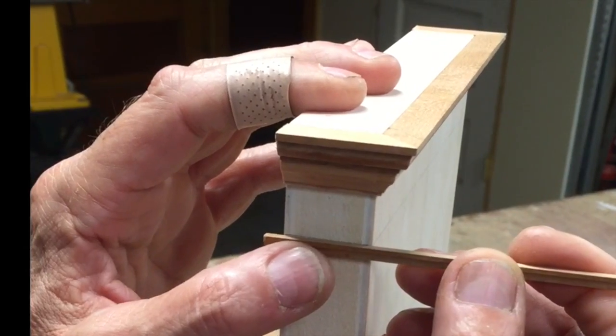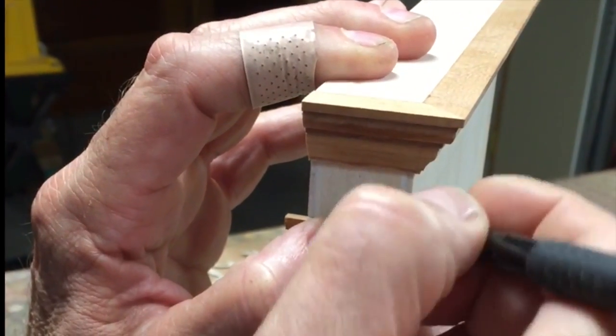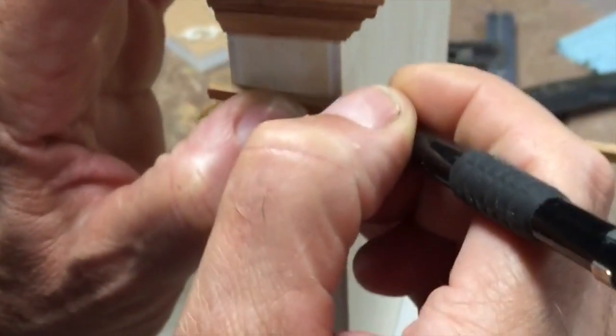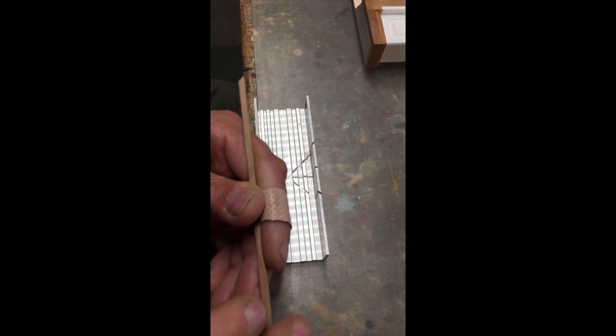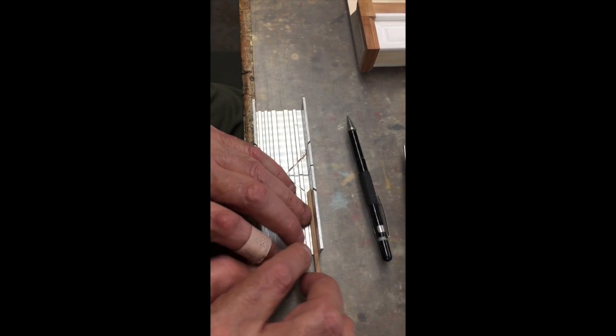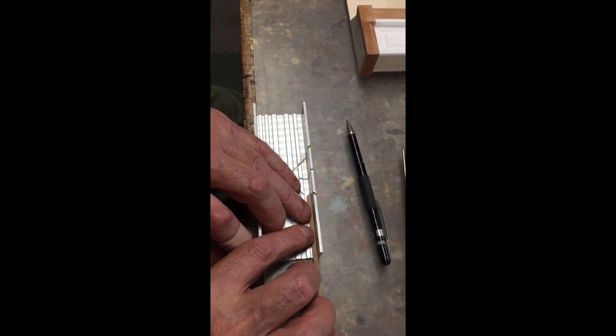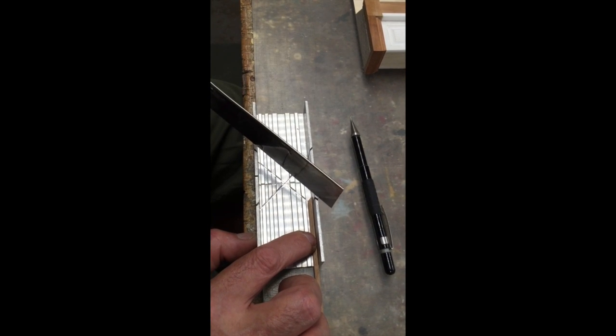This piece of molding, we're going to leave it a little intentionally long. We're going to cut a miter in this neighborhood here. Next we want to cut the opposite angle — this will turn into our longest piece. So you don't get crossed up with righties and lefties, one side will be easier for some and harder for others.